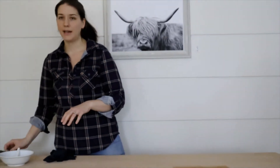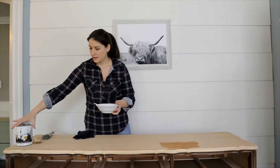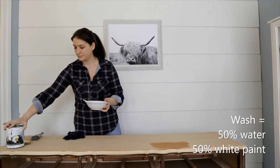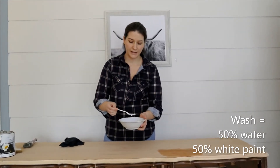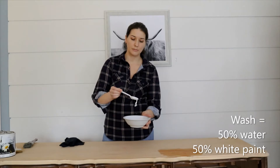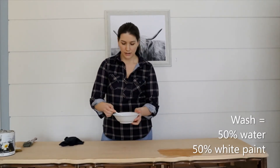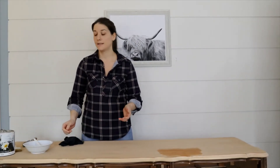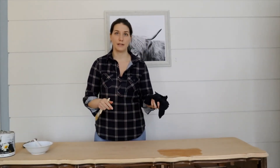The way we're going to do that is using a mix of cottage white mineral paint by Cottage Paint, with water added — about a half and half mixture, so it's pretty watery. What I'm going to do differently than just a straight whitewash is apply it more like a stain — I'm going to use a chip brush, paint it on, and then wipe it back with a lint-free rag.